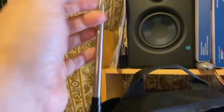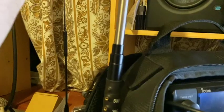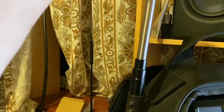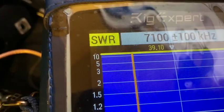The next thing I do is to slowly just push up the sections of the antenna and we should see the SWR go down. Doing this with one hand is a bit tricky. The initial result is a very high SWR of 42.3. So let's keep pushing up — I push up each section until it clips the other one and then have a look at the SWR. We're going in the right direction: two sections up and we're down to 39.